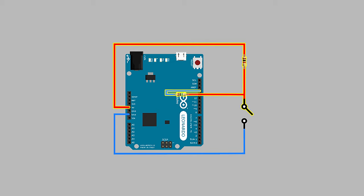In the dance pad, each button is constructed out of three metal plates: one connected to the small resistor and 5-volt line, one connected to the ground line, and one which closes the connection between the two by being stepped on, causing the other two plates to touch. While the dance pad's buttons could in theory be constructed using only two plates, having the plates with the electrical connections remain stationary lessens the chance of failure, since the connections do not move during gameplay.